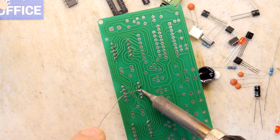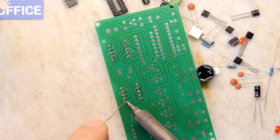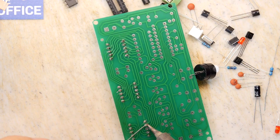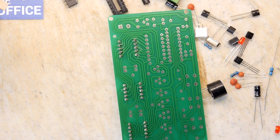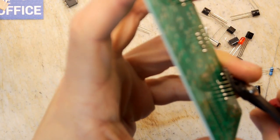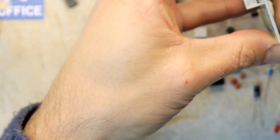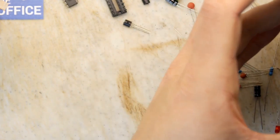Yeah, that'll do nicely. So I'm going to look through here. I'm not sure how they're doing the timing for the chip. So either it's got a built-in oscillator, or it's using a resistor capacitor. So that'll be interesting in terms of its timing. It does seem to be a clock, because it does have hour, minute, seconds, although it does have a buzzer, so maybe it could just be a countdown timer. I don't really know which it is. If it's a countdown timer, it probably doesn't have to be quite as accurate, because it's only going to count down for whatever you've set it, which probably would be a maximum of 24 hours. So if it's accurate enough within a 24-hour time span, they'll have got away with it, won't they? Not like plus or minus, you know, 1 second per month or something.